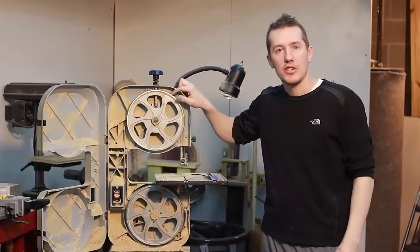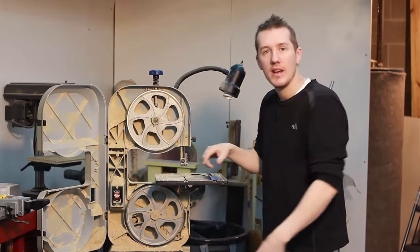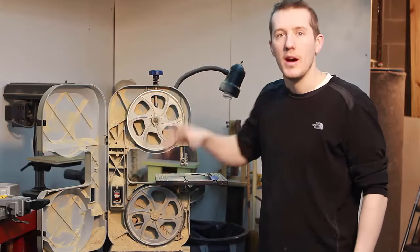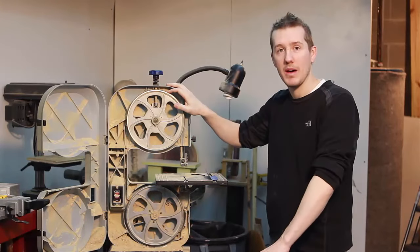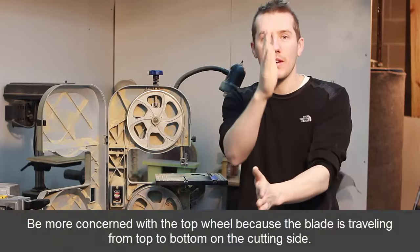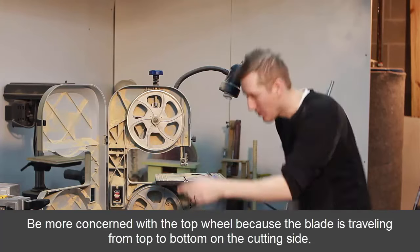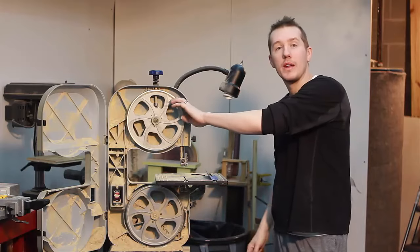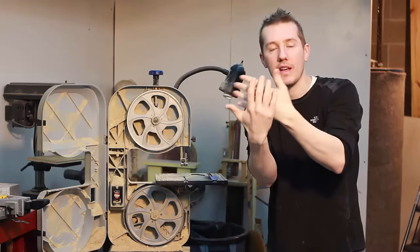So those things — sharpening the blade, centering the gullet on the wheel, setting the blade guides, and tensioning — this saw is cutting better than it ever has. The main thing I learned was not getting the blade centered, but getting the gullet centered, and critically on the top wheel. You're not as concerned about the bottom — they don't have to be coplanar or aligned, as long as you're centered on the gullet on the top. The teeth on the bottom are actually a little off the wheel, but it's cutting great because on the top the teeth are supported and not flexing offline.